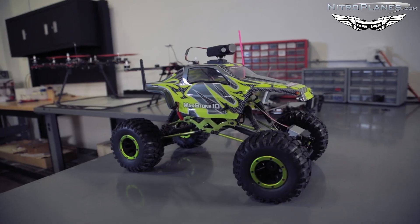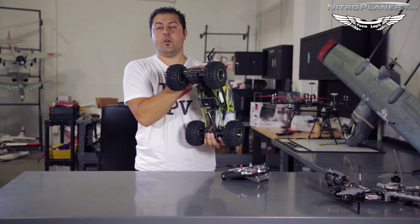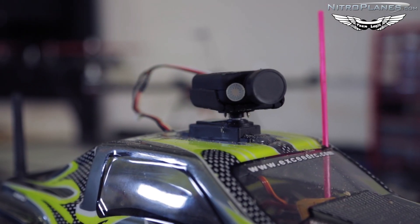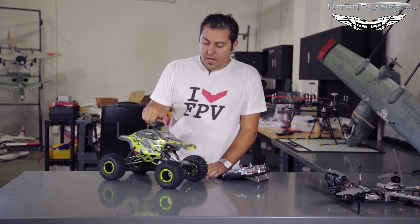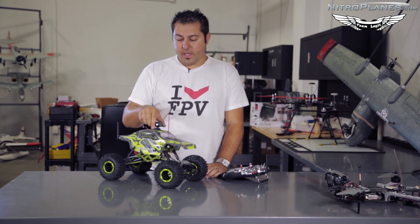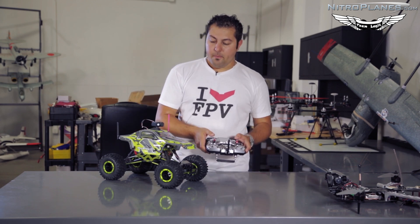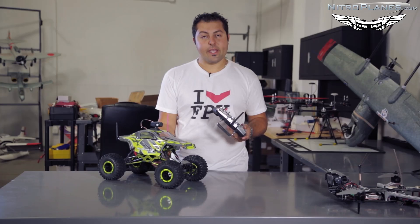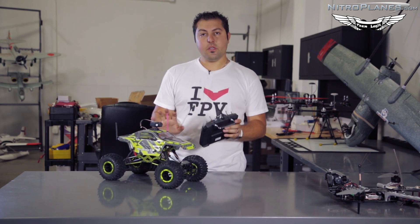You can run a simple setup like this with just a 5.8 gigahertz video transmitter stuck on the bottom going straight into a little micro camera. This camera is the Mobius camera. It also records on a simple servo with pan function on my RC car. This 5.8 gigahertz video frequency plays well with both the 2.4 GHz and the UHF system, so it's a very simple setup.